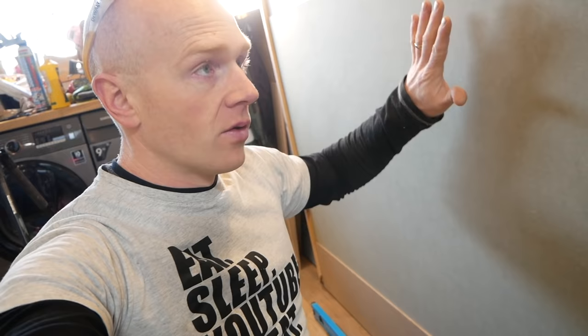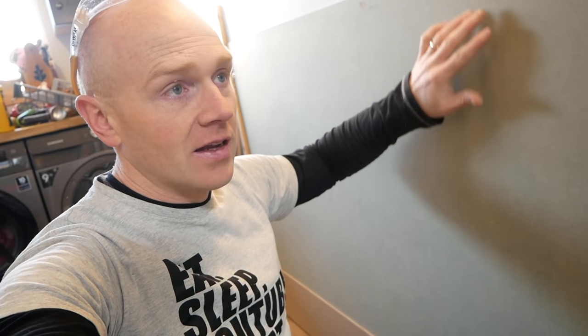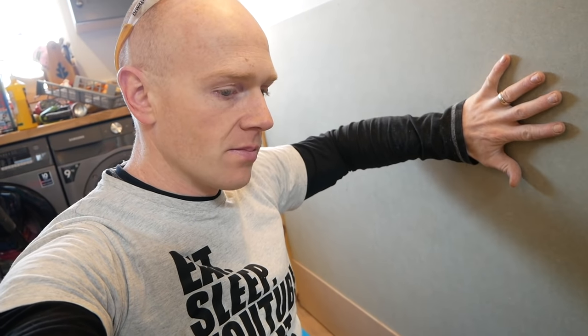So there's a couple of things to point out. The adhesive you use, you want to make sure, in the past I've tried grip fill and all those sort of adhesives, they're fine, but when they skin up, they keep everything proud off the surface. They don't squeeze nice and flat and hold it tight. So while it doesn't matter quite as much for these, something that's thinner setting, either a water-based one or a polymer one like that, just tends to work much better.